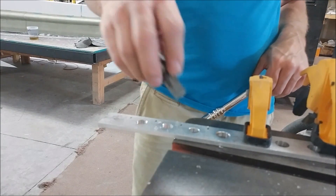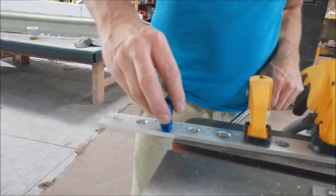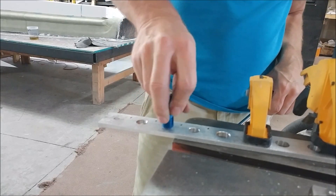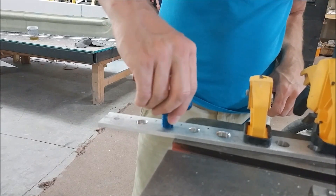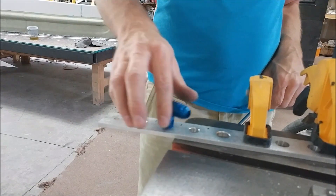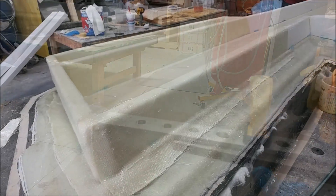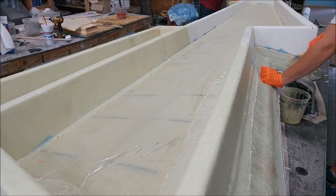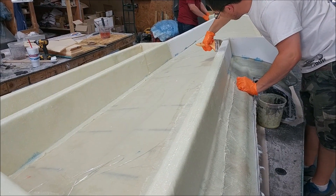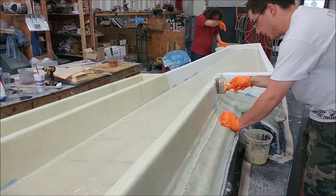The reason we're working on the tank right now is that we have to have it together before we can bond in the aft pressure bulkhead to the regular aft bulkhead that's already bonded to the main spar, since it lives on that aft bulkhead wall. We want all the fittings in place already. Meanwhile, here's Zach and Devon working on glassing the bracing into place on that last upper wing skin mold — that's the last thing needed before it's ready to lay up the wing skins.